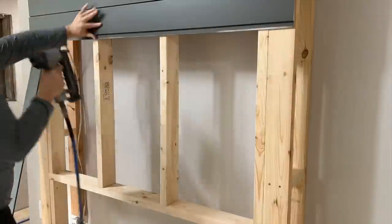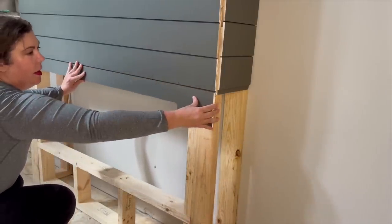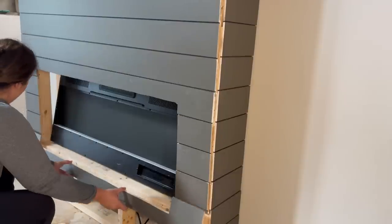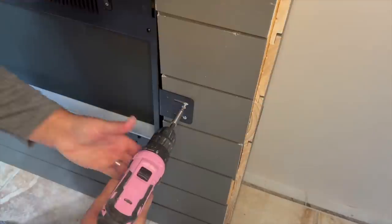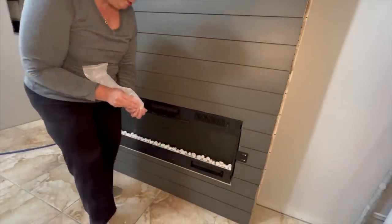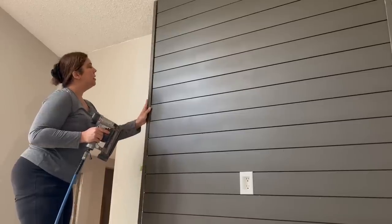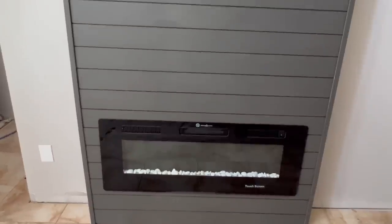I'll go over this with a little more paint later and make sure it isn't visible. I continued adding shiplap all around and then, when it came to the fireplace area, I cut out the shiplap a little bit to frame it around the opening — you can do this with a jigsaw or multi-tool. I got really lucky that my last piece of shiplap ended exactly on the floor. I may still add baseboard later so that it'll look perfectly built in. The electric fireplace comes with brackets that attach to the side, and these brackets attach to the shiplap and the 2x4 behind it. I added the decorative rocks and placed the glass cover onto the fireplace. I had someone else add an electrical outlet into my build since this wasn't something I was comfortable doing myself. Trim pieces — called outer corner trim pieces at the hardware store — cover up the edges and make it look professional. I turned it on and I was so happy with the way it turned out.